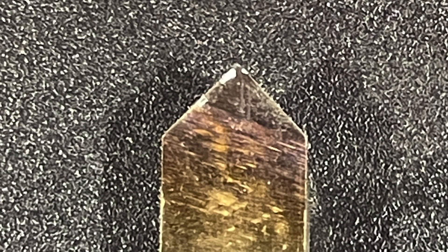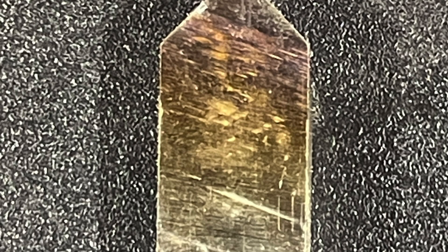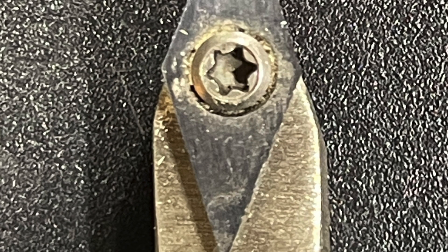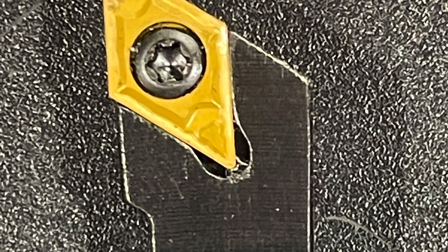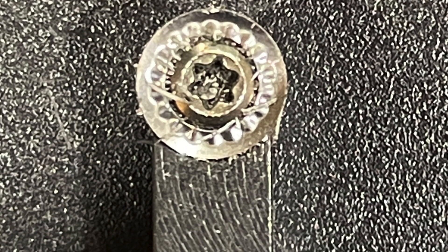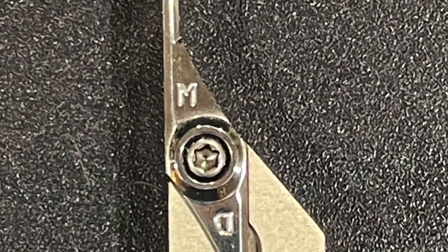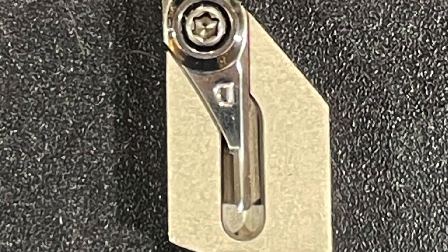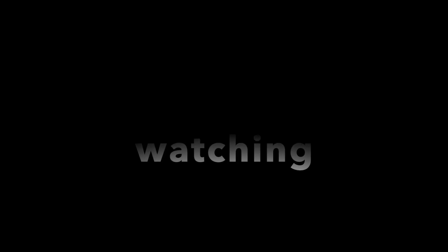I would not do threading with an open-loop stepper motor because I'd worry about missing steps, giving an imperfect thread. But with a closed-loop stepper motor and the pulley ratios I'm using, it works quite well. Now a short word about cutters: a flat high-speed steel at 60 degrees doesn't work very well in wood. A very sharp flat cutter like you might use on a wood lathe also doesn't work that well on a lathe like this. Typical metal cutters really don't work — they're too blunt. The best success is with cutters made for aluminum, like this 8mm button cutter with very sharp edges. For fine work I found a specialized cutter — almost like a Z — with a 2mm tip, straight raised sides, very sharp, originally meant for aluminum. I've tried to present some basic features of GerboGru lathe in this video. I hope it is helpful to someone — thank you for watching.